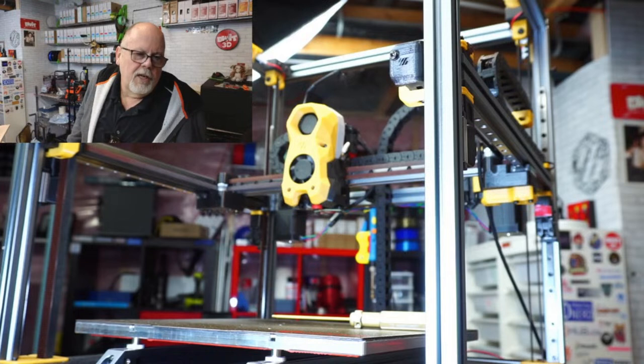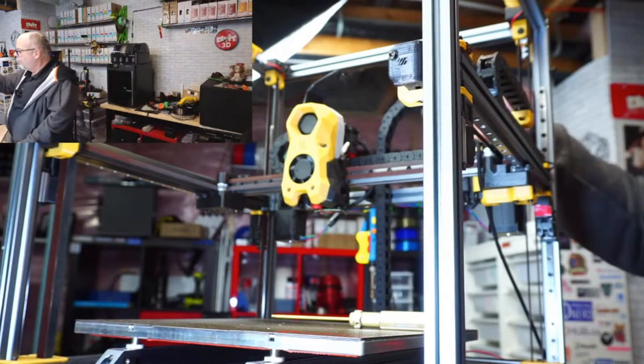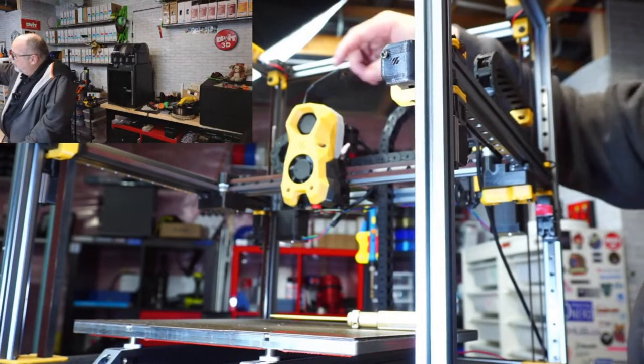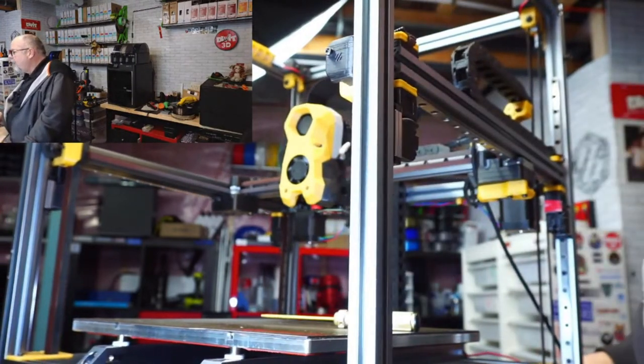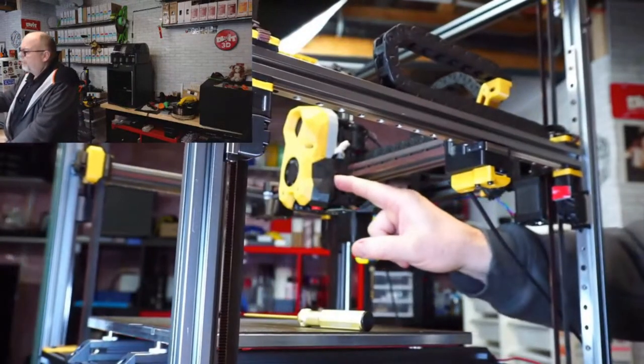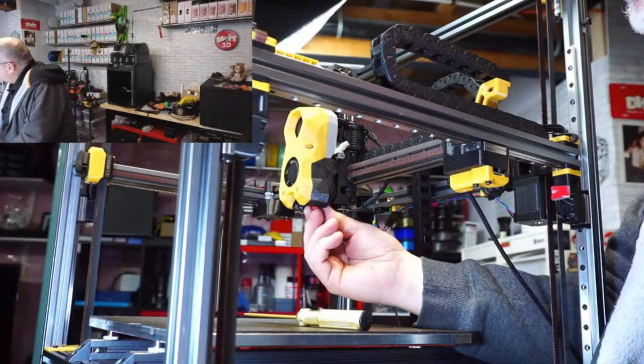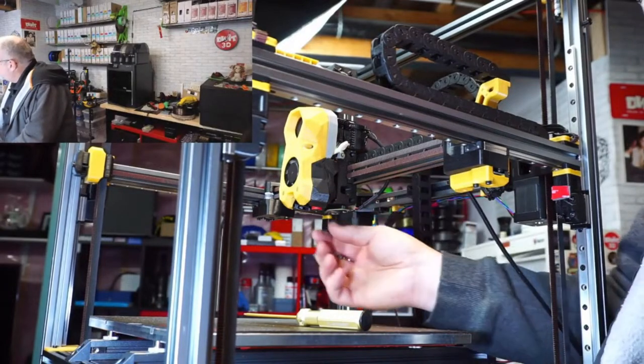Goes to a set position, then homes Y. Yeah. Home X first. Yeah, there's a lot of ways around it. But I mean, if I could figure out a way to run the wire through the tool head path, that would work too. But it's a pretty thick wire. And if I come down through here and then out here and around, I fear I'm going to be too close to the hot end with this cable.